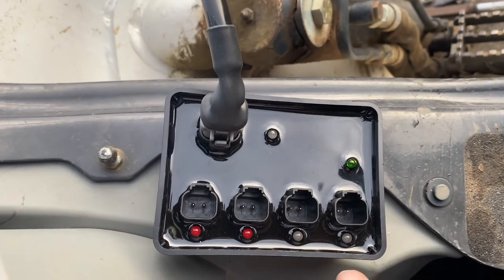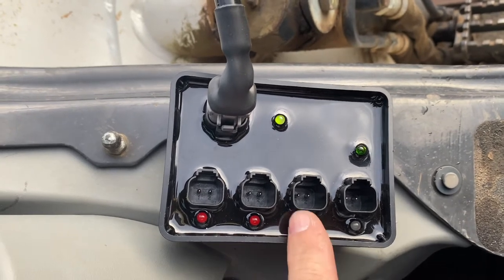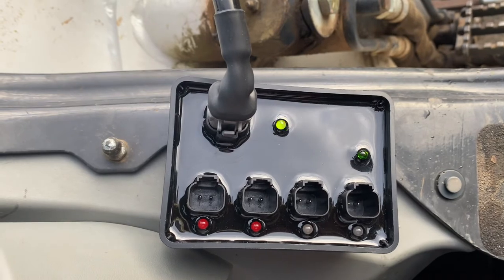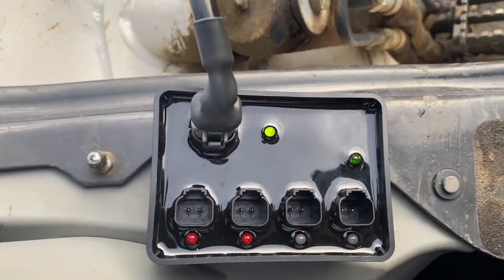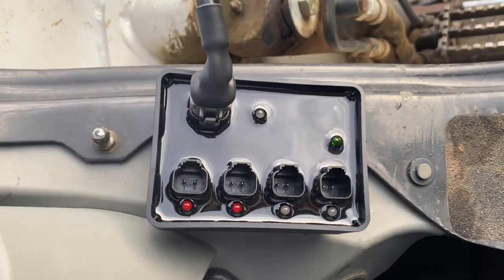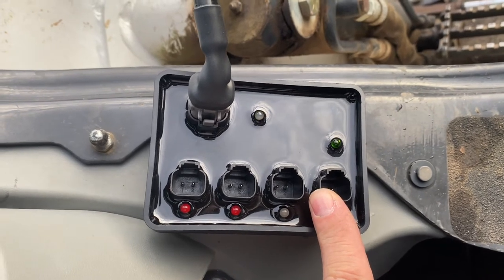That's enough to run on a snowblower. That's going to run your motor to turn your chute left and right, and then it's going to run the linear actuator that's going to open and close the angle of your chute. And that's from these two ports here. Now, if you're one of those people that bought a Buffalo turbine, you can choose either one of these. You're only going to use one of the ports and you're going to plug directly into it.